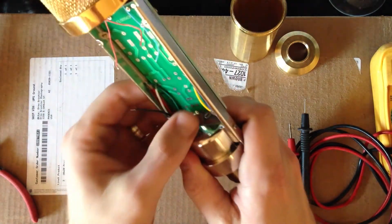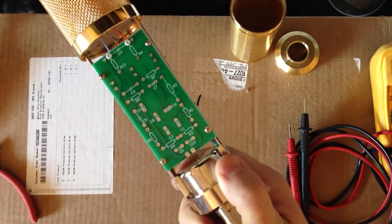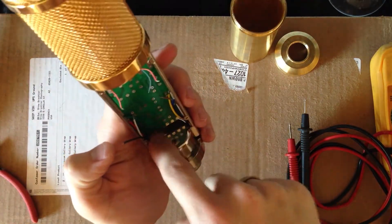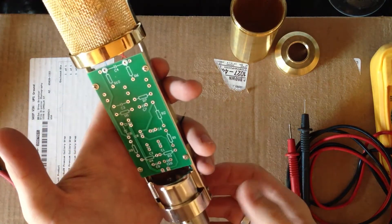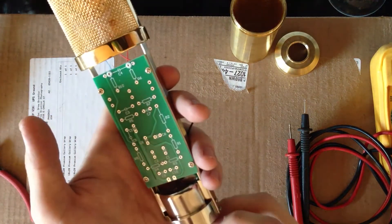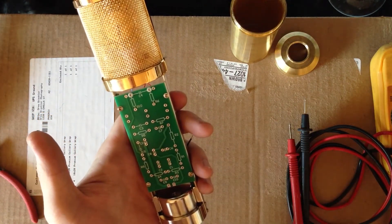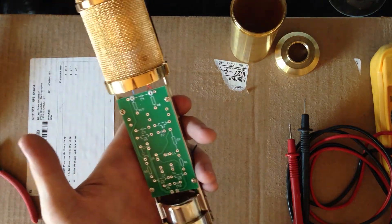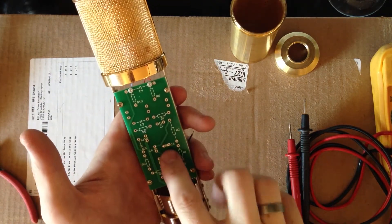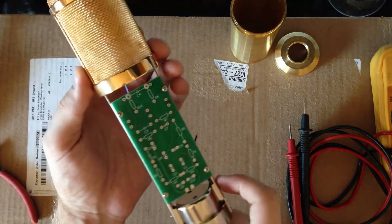Moving on, we have the PCB board right here — this is the back side, this is the front side. We have our seven wires from the XLR connector coming up through the body, ready to wire in. The next portion of the videos are going to be me installing components, kind of one by one. I'm not going to give a full rundown of where components are going because they're all labeled here. There's also a schematic that you receive when you purchase the kit — you just need a general sense of being able to read that, figure out the component values, and place them where they need to go. Also verifying if there's a polarized capacitor, which side is negative, which side is positive. I will show you guys some of those important things later on.